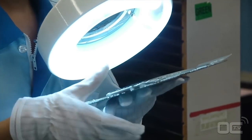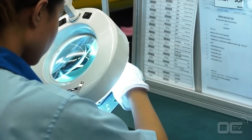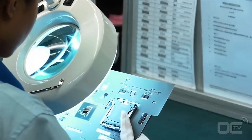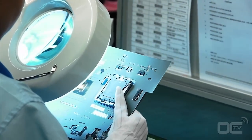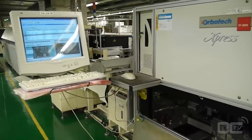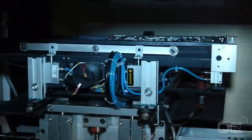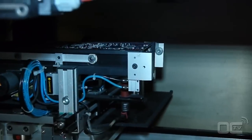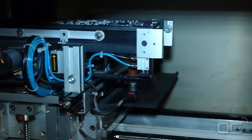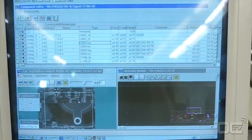Your motherboard now has all the small resistors as well as the chips and the socket. It's time for visual inspection, which avoids any misplacements or missing parts. Components smaller than 2mm can't be checked by visual inspection, which is why we have the AOI machine — the automated optical inspection machine — which checks for any missing or misplaced components and also checks all components with visible soldering points, like the audio chip.